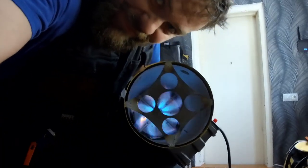We pull the clothes pins and the canvas rises to the ceiling. Now turn on the gas gun and heat the canvas. In one place, do not linger. Let's start from this angle. We warm up from the center and move to the corner so that it warms up well.